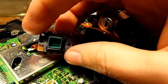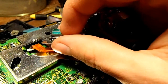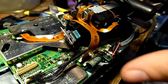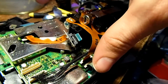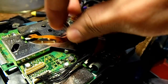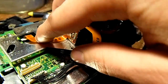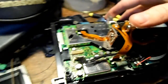One interesting method you can use these for is to copy film. I had one camera that I took apart - actually it was a webcam - and I put a piece of 8mm home film over the CCD chip. I would take a screenshot, move it one frame, take another screenshot, and that way I could get a high-definition image of each frame on the film. That was a nice way to copy the film over, and then you can reanimate it with several good programs.